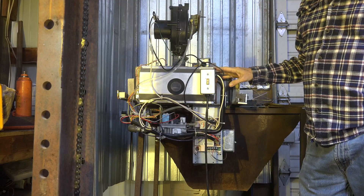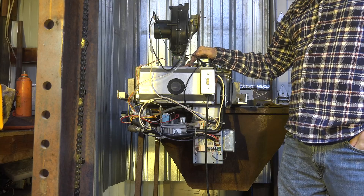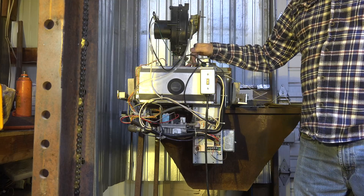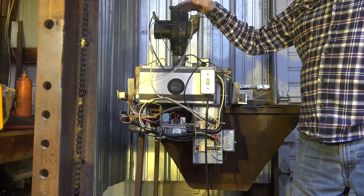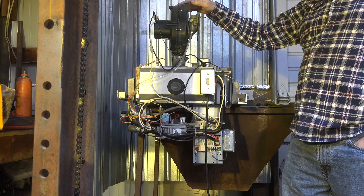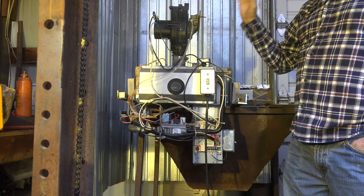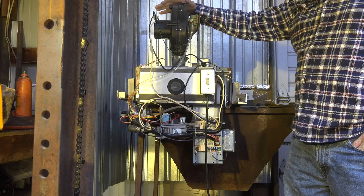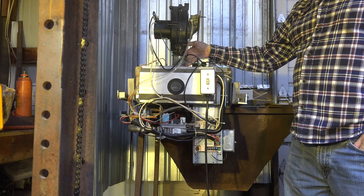Now this is a little different here. On the very top, that's where the combustion air normally comes in. The furnace was designed so that the inducer pulled air through the furnace, so the furnace was actually at a negative pressure inside the burners — this whole area here was negative. In this case I've changed this and switched it to a positive pressure. I've taken the inducer and put it on where the return combustion air was.